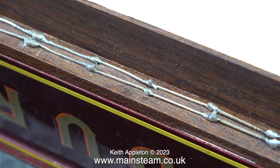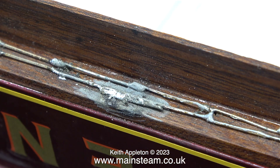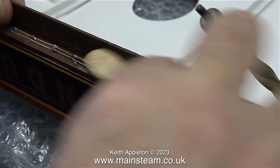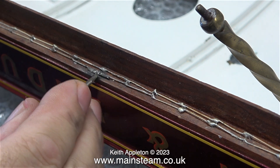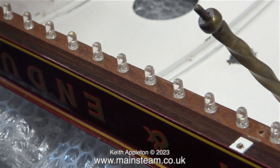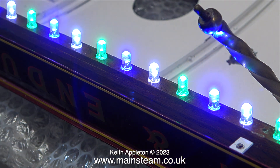I do remember that drilling all of the pairs of holes took some time. I've reinforced the connection with a long piece of copper wire to illustrate a better approach. Now all I need to do is scrub away the flux using one of my semi-green bamboo toothbrushes with nylon bristles. With the area cleaned up I applied some power — about three volts from the variable power supply — and the lights glow quite brightly.